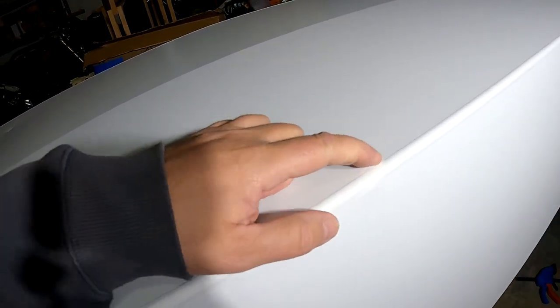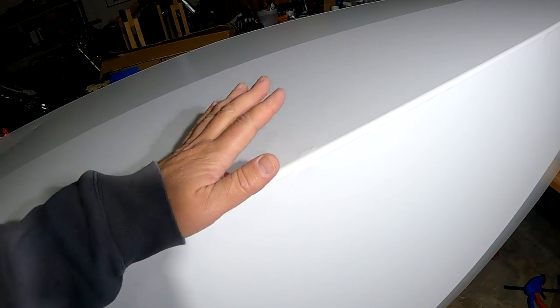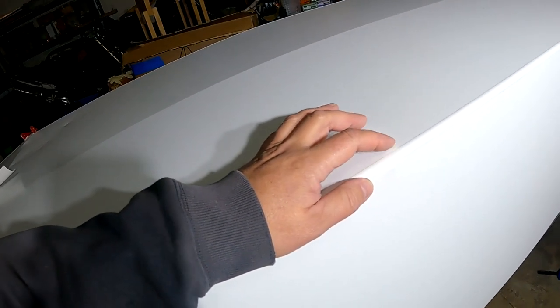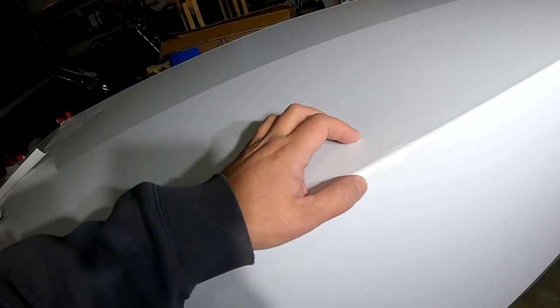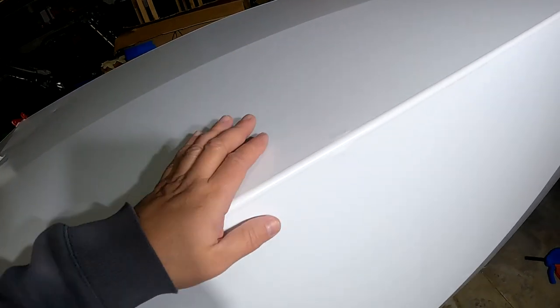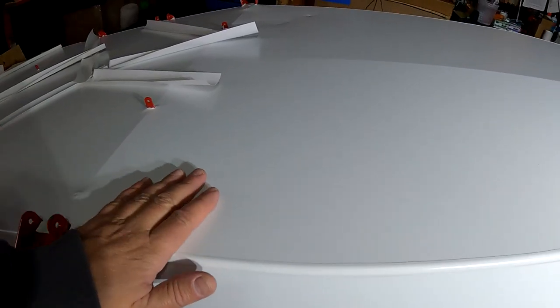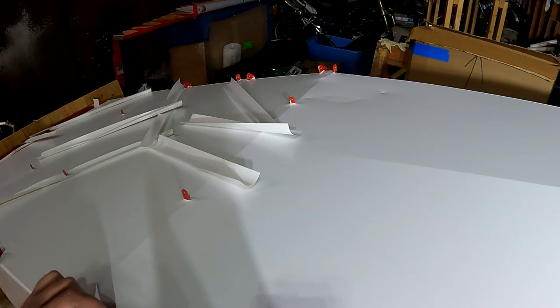If you've been watching the video and you don't see me mention it — this stuff right here is not lumps of glue or places I screwed up. This is a weld bead from underneath. Disclaimer: this is a Sky Star welded fuselage, this is not a current Kit Fox production. I've seen people make remarks about the weld bead being visible and knowing it's going to print through like this, so they grind it off. Being an engineer type, I'm really reluctant to grind it off and have to retreat the surface so it doesn't rust. I'm just going to live with the fact that most fabric-covered airplanes are a little bit lumpy and a little bit flawed — just like myself.